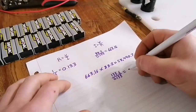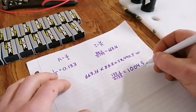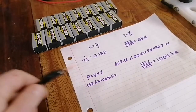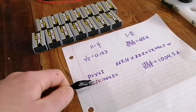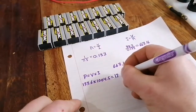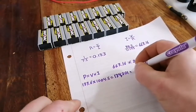Running those numbers, we get 1,004.5 amps. Awesome. Of course, I'm going to have to figure out how much power that is. So here's our equation for power: voltage times current. Voltage is 133, our current is 1,004.5. And running those numbers: 134,201 watts.